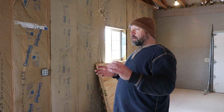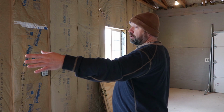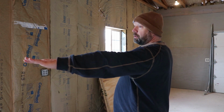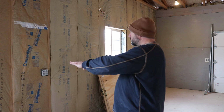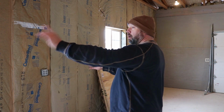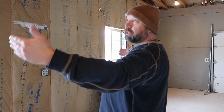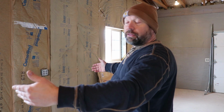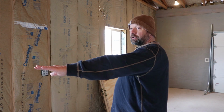The other item is workbench space. How much workbench space are you going to need? So my shop is basically 32 by 16. So this whole wall is going to be workbench, with the radial arm saw right here in the center. So that gives me from the center of my blade all the way to either end of the wall probably at least 15 feet, since the inside dimension is a little bit less than 32. So I can set a board up there as long as my benches are clear. It'll have a clear run to use the radial arm saw.